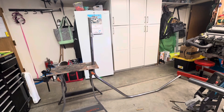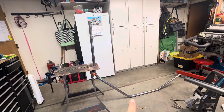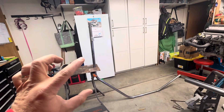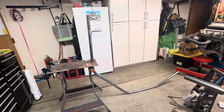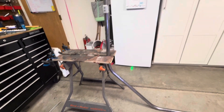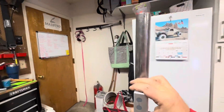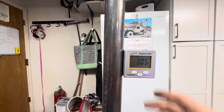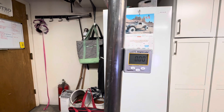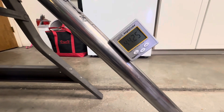I'm happy with the placement of the tube and how it fits inside the vehicle. One thing I didn't know was the degree of bends for each one — I started with something close and kept bending a little bit more until I liked it. The problem is now I don't really know how to duplicate it. So what I'm doing is using this little clamping table, which I love. I set up this bar vertical so it's at zero, zeroed it out, and I can set it on the bend to get my angle — 44 and a quarter degrees. I can do that for all the different bends.